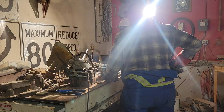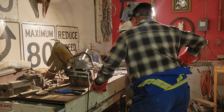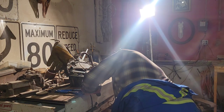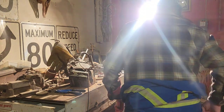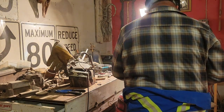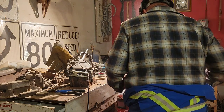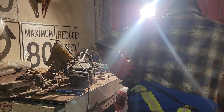So, due to our lack of experience, we kept having this same issue come up during this little welding session. I'm just trying to show Clint how to basically glue with metal here, which I've done hundreds of times before with no issue. But with a combination of lack of experience and perhaps the wrong welding tip on the gun, we kept having this same issue where when the tip touched the workpiece, it melted closed and then bound up the wire.